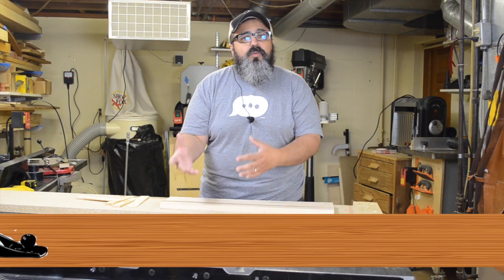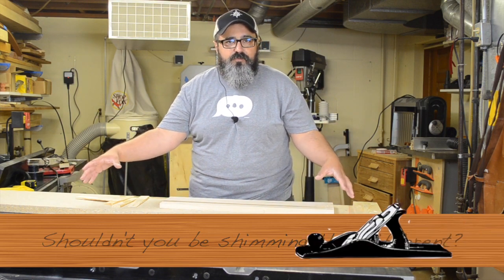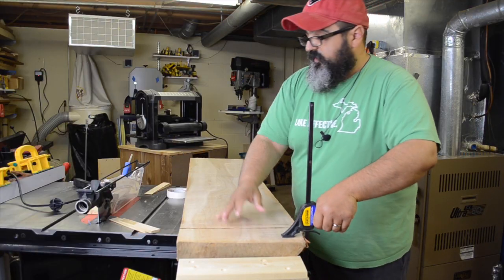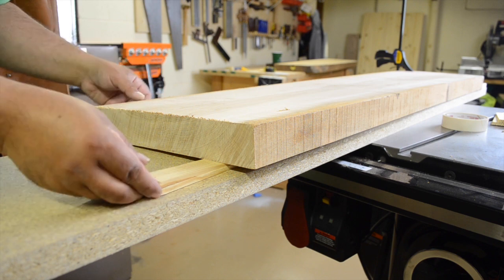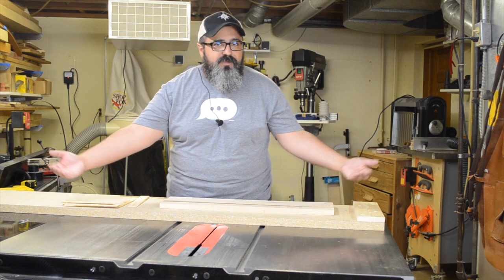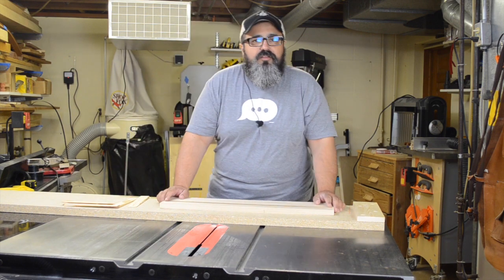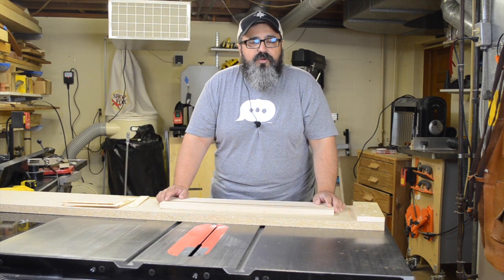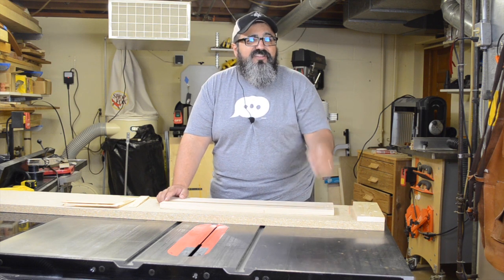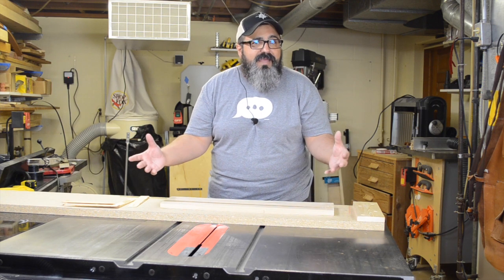So the next thing I want to talk about was the most frequent comment and suggestion that came in, and that was regarding how we shimmed the material to the board. As you saw, I ended up clamping down one end and it really kind of raised the other one, and allowed me to get a really good shim in there, which meant I only had to adjust one end. The comments coming in were talking about maybe if you had shimmed at both ends, you would actually be removing a little bit less material along the whole entire length of the board. And that's very true — in my situation, the material I was working with I was going to go for something thinner in the final product, so it really didn't matter to me that much.